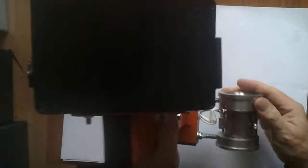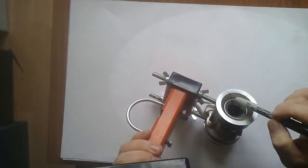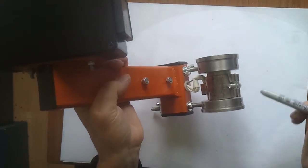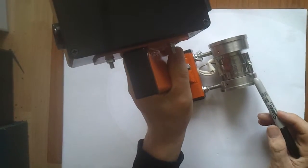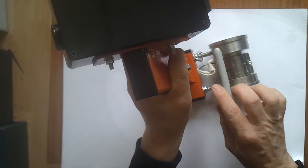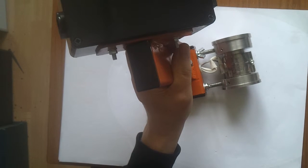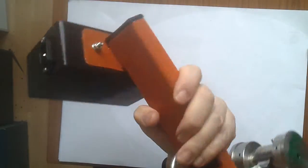I'm very pleased with the injector myself — it's really over-engineered. This is a stainless steel ring on the top with a funnel to allow you to tip your pellets in nice and easily. It's removable, located on these grub screws which bite into recesses in the central barrel. The bottom ring is also stainless steel. All the wiring disappears internally into the support structure and emerges into the box with no external interruptions — so it's really portable, self-contained, and robust.